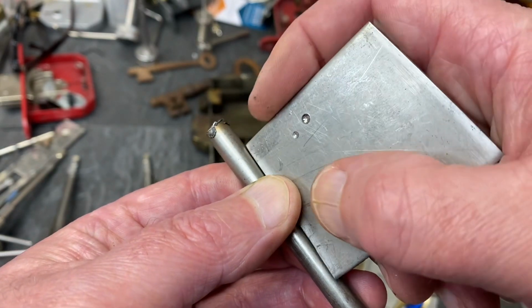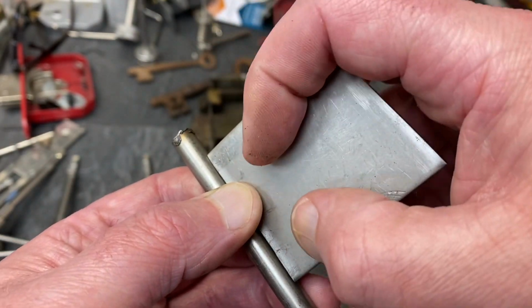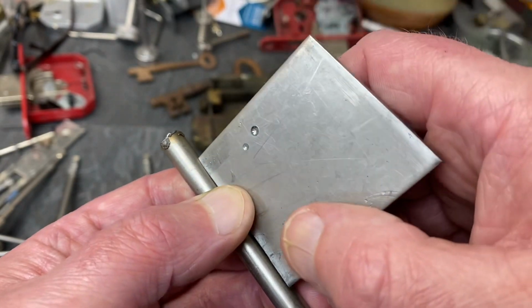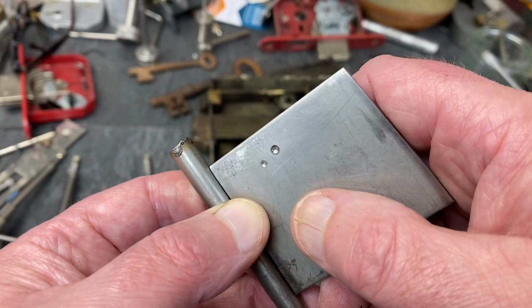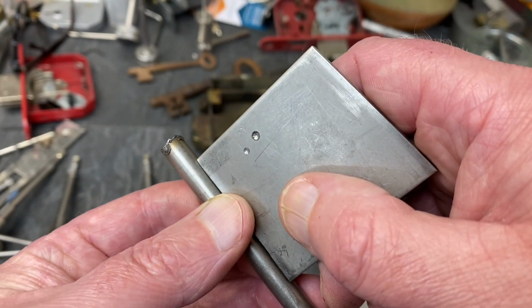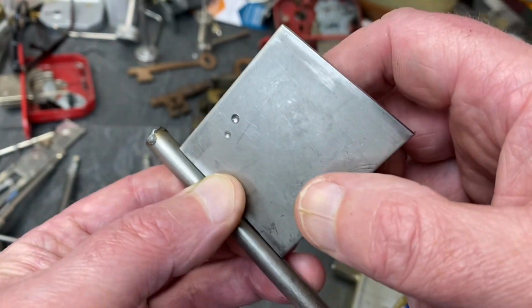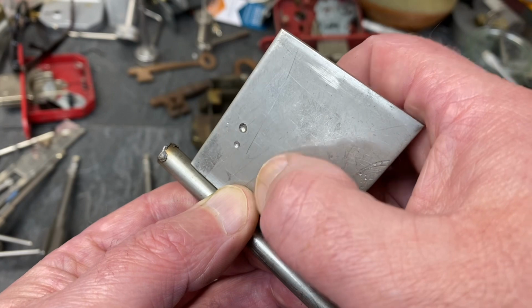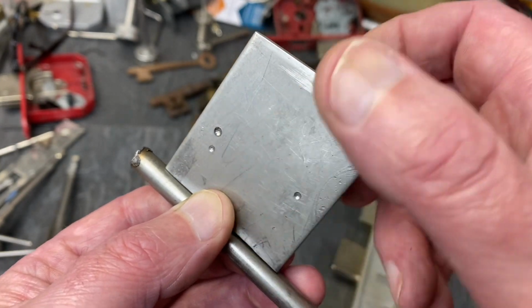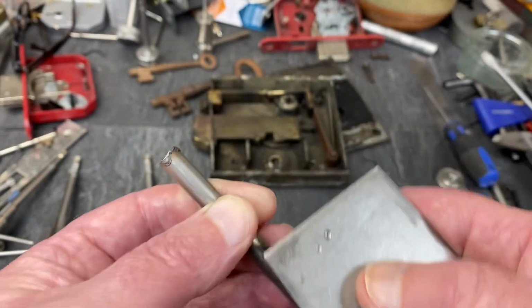And then I'm going to have to cut warding on this side and warding on that side, and then make sure I've got it to the correct diameter for the internal case. So it's going to be a bit of a pig, but first of all I need to get the basics. So it's going to be like a groove, drop that in, silver solder that in. I'll try and cut it as near as I can at this point when I'm going to drop that plate in, but it's still going to be slightly oversized. And then I'm going to get to work on a file, and then slowly but surely.